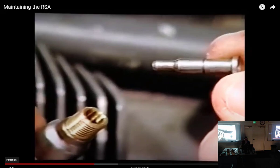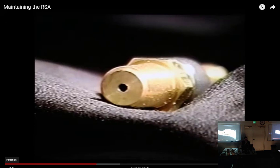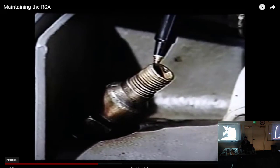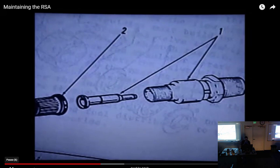The nozzles used with the Precision Airmotive fuel injection system have a fuel orifice diameter of approximately 28 thousandths of an inch. As mentioned before, the only proper method of field inspecting these assemblies is through the use of a 10-power magnifying glass. With older style nozzles, check the top threads at the fuel line connection for damaged threads and/or cracks. New and old-style nozzles for normally aspirated engines are interchangeable with one another and may be used in any combination on an engine.